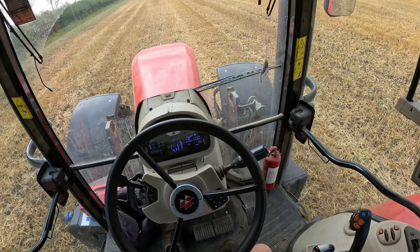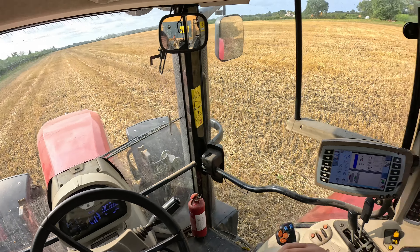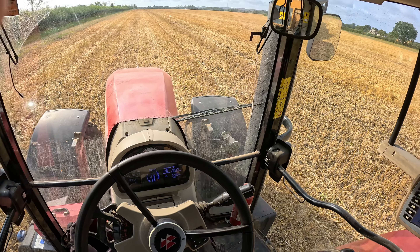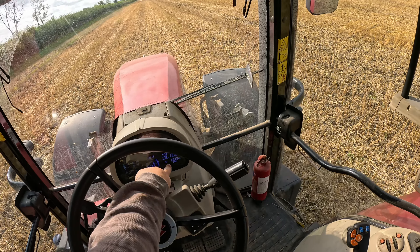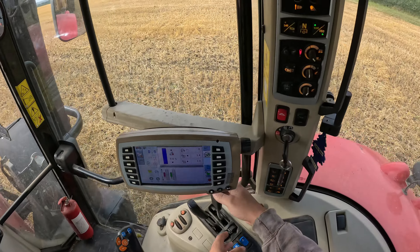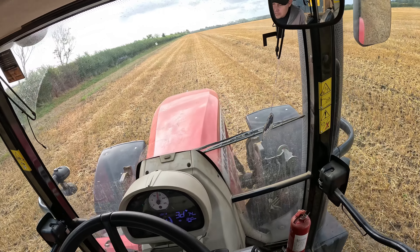I'll put the camera on my head so you can see what I'm doing. First thing you always do is turn the rotors on. We're set on 1000 PTO speed — it's easier for the tractors to turn the rotors at 1000; when you're on 540 they're sort of geared down a bit. When the rotors are set on 1000 you're also less likely to break a shear bolt. So we put it at 1000, open the doors halfway, and then simply run the bed in and lock the spool on. Then you want to get up to speed as quick as you can.